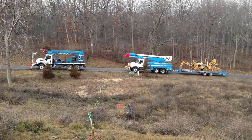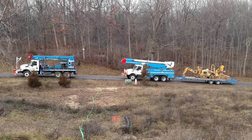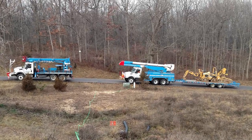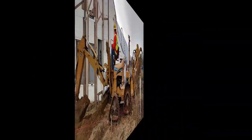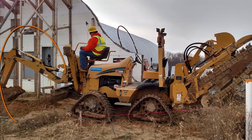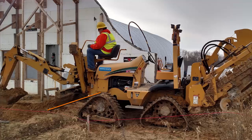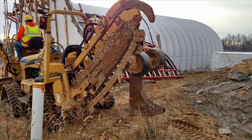There's a whole lot more detail about the ridiculousness of this whole thing on the website, but the trucks and about five guys were there for two days and probably spent less than three hours actually working. The digger machine was very custom — it was like a treaded Swiss army knife. It had an excavation arm on the front to start the trench and then flattened the ground with a horizontal blade. But most of the trenching work was done with a plow-chainsaw combo tool on the back. The plow blade actually has a hole in it for placing the wire as it cuts and then just recovers the trench as it moves forward.